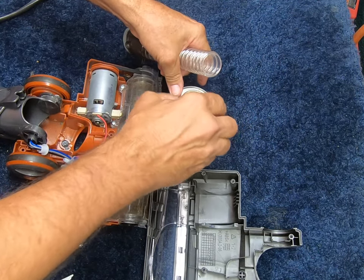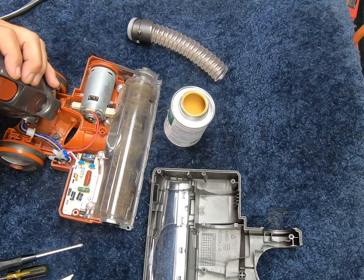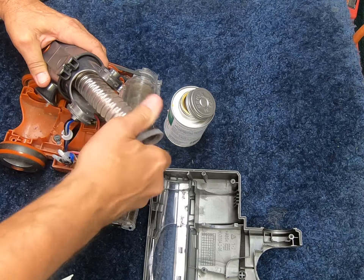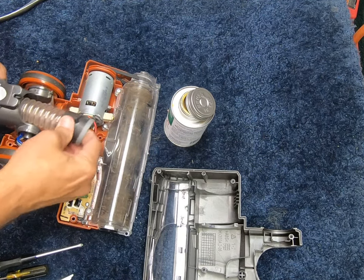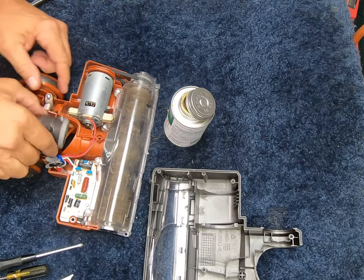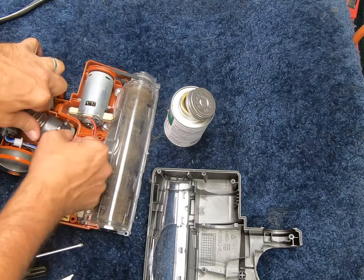I'm going to put a little bit on the inside of the coupling and go from the tap here, putting just a little bit around in there. Now I take the hose and thread it into here — once again, counterclockwise. So that's pretty tight. It's going to set in place like this, so my round circle is pretty much lined up good, just need a little bit more of a twist. Now that's going to be perfect right here. The whole perimeter of this coupling will go on the inside of this opening, and then this circle here will slide right into the opening there and be set in place.